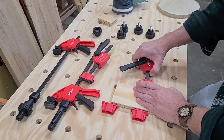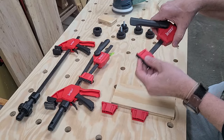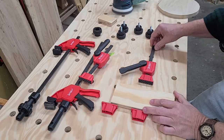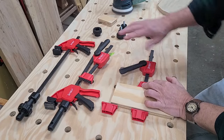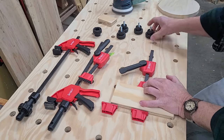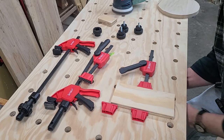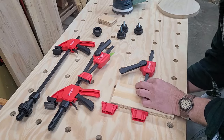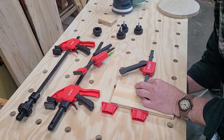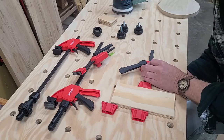This plunger has six inches of overall reach and the plunger itself moves four and three-quarters of an inch. One common complaint is that it tends to lift your work — you can actually see that part lift up slightly. The way you compensate is to take one of the knobs, come from underneath, put it in the post of the horizontal clamp, and tighten it down snug to your bench. That will greatly minimize parts lifting — almost zero.